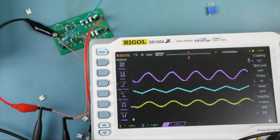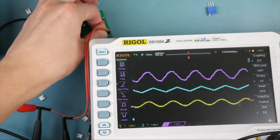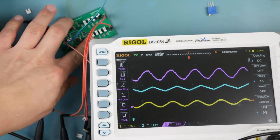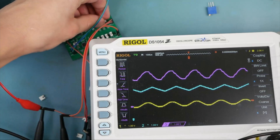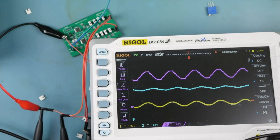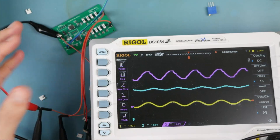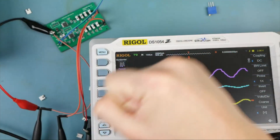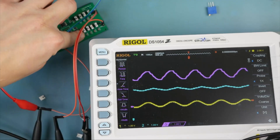How about 20 microfarads? We are actually pulling current now — those transistors are heating up. We are pulling about 7 milliamps driving this waveform. This op amp is actually pretty fantastic. I should have used a cheaper, crappier op amp. What's happening here is quite simple — this circuit is still stable, but this is just output current limiting. It's trying to drive but it's limited by what the op amp can do. So we have a triangular waveform on one and something that looks kind of like a sinusoid on the other — that is incredible.